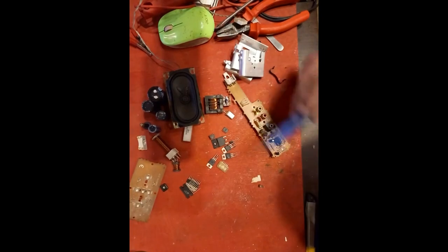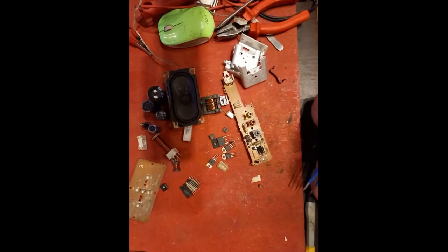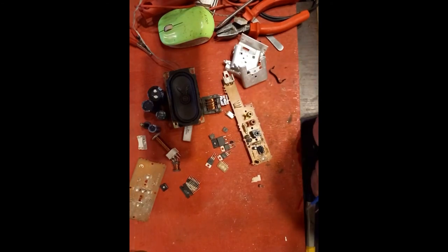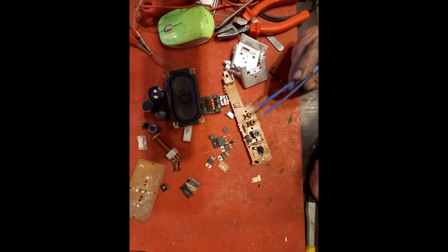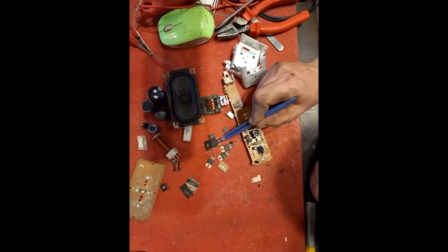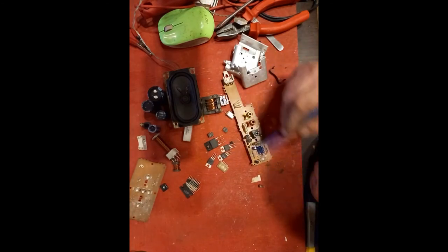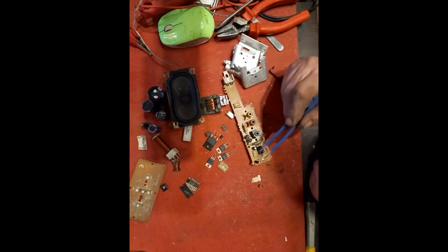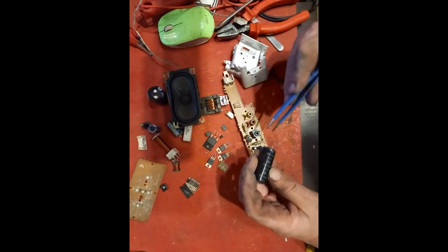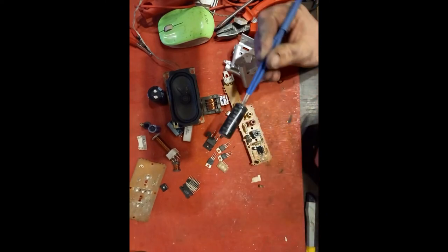And we've got a filter there as well as a host of cables and some heatsinks. It's a whole host of stuff that can be reused, especially these chips and the LM317 voltage regulator if you're making any circuits that need voltage regulation, and the big NPN power transistor. All good quality, branded parts — not Chinese ripoffs. The capacitors are also all good quality parts, all looking good on the ESR meter.